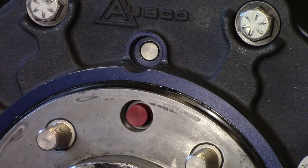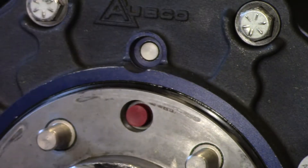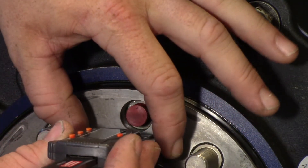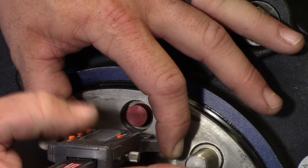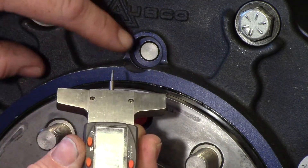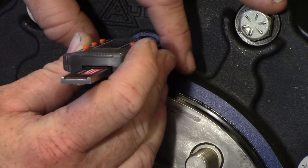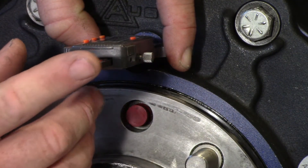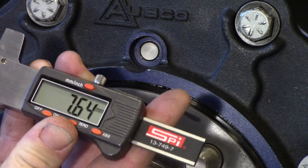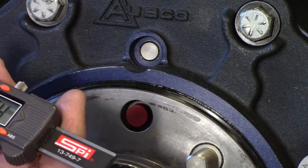Take a rag and wipe your actual pin face off — make sure it's clean. Then take your digital depth gauge, put it on the hub and push all the way against it, verifying it zeroes out on the hub. The hub is a perfectly flat face, so it's a good place to zero it. Now place the gauge halfway between the middle and outer edge of the wear pin and push the depth gauge in flat against the brake. Our reading is 7.64 millimeters. Anything over 7.62 millimeters is considered a new brake. If the pin measures 6.48 millimeters or less, the brake is worn and requires rebuilding.